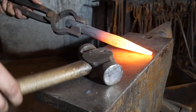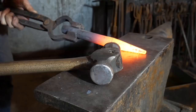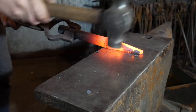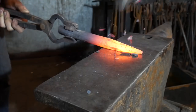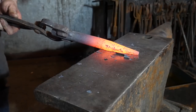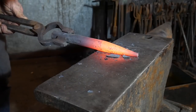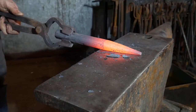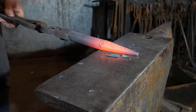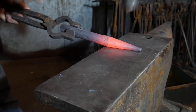I'm going to try my hardest to show you this again during the heats — it's quite hard. What I'm going to do is lay a corner of the octagon on the face of the anvil and start forging the corners off, rotating it around to the next one and the next one. Once you get all the way round, you should find the anvil has done half the work for you. I'm also working up and down the length to help prevent the shape from twisting.